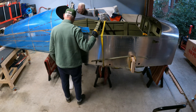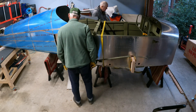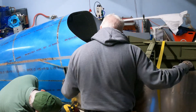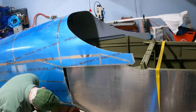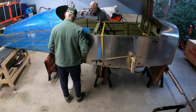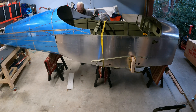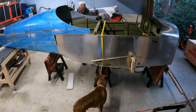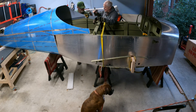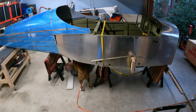We figured out we were a little bit twisted on the empennage because the holes weren't quite lining up. We were trying to figure out — do we need to go left or right? Take a mechanical designer and an electrical designer and you get indecision! We finally started figuring out which way to rotate it just slightly to get everything lined up. You can see a little bit of a twist as we slowly walk the empennage skin underneath the baggage compartment ribs.